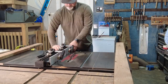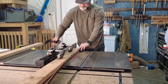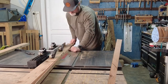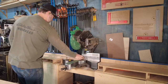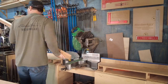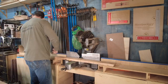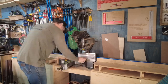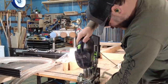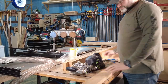Another use for this sliding fence is when you're trying to rip longer pieces — you can pull it back to have more fence before the blade, which makes it easier to get a more accurate cut. The longer pieces for the headboard and footboard I'll cut to final dimension at the miter saw. I check for square after each cut and pay special attention to where the imperfections and knots are, to try to eliminate and cut those out where I can. Once everything is cut to dimension, I sand everything down to 120 grit, then it's off to the Festool domino joiner to do some loose tenons.